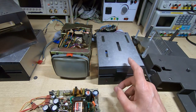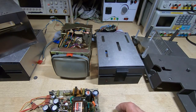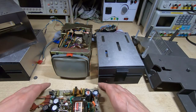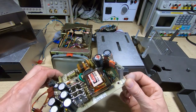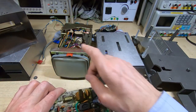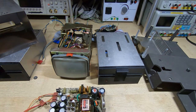The inside of the monitor housing is dirty and rusty, so I think this has been stored somewhere damp. Luckily it hasn't gone too deep, so most of the material is still there. The real issue with this sort of machine is what the corrosion will have done to the disk drives — they are the part most susceptible to damage through corrosion. In the next video we'll start with the power supply, probably put a dummy load on it to make sure it works as it should before putting it back together. This jumper is for 115-volt operation but we're running it on 230 volts. Next video we'll start working on fixing all the faults.